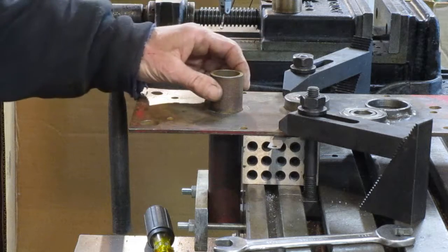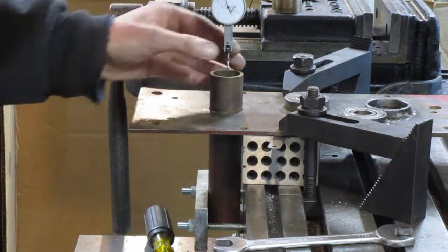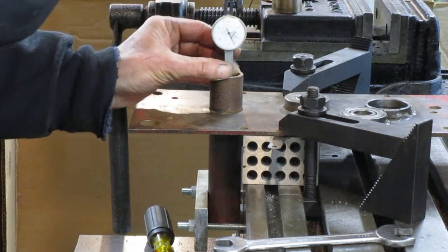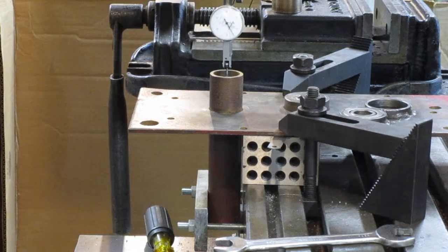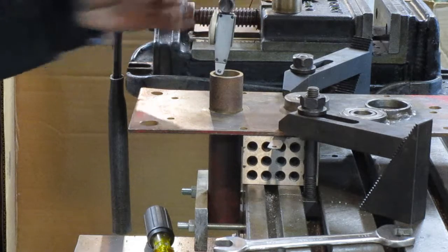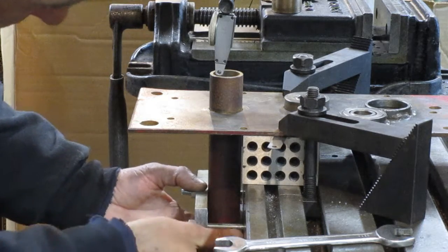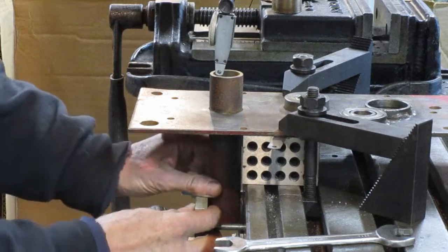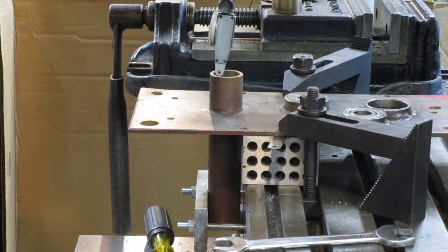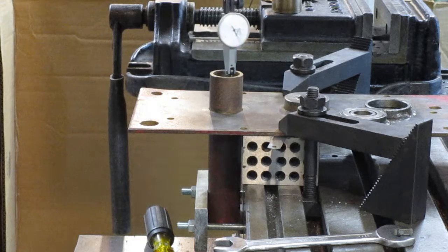So all I care about is that I'm lined up with the existing tube. I actually have this shimmed from side to side — I've got some feeler stock here. I shim it from side to side until I get this indicated to where I don't have any variance vertically. And I do the same thing in this direction — I flex the tube out and put feeler gauges behind here and clamp that solid. I use feeler gauges for both axes, so now I'm true to that bore in addition to indicating to find the center of your bore.